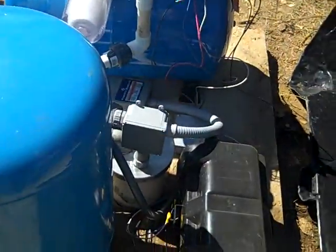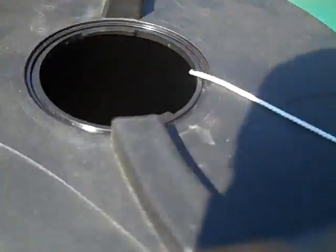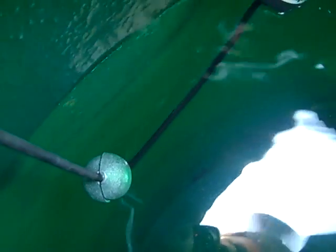Next I'll show you the tank — it's about a 1,050 to 1,100-gallon tank. Taking a peek inside — very good. We do have some plastic debris from hole saws but we're almost full. We've got a Septronics float switch in here that's just about ready to shut it off. It uses a weight to tether it down so when the water rises and the float comes up, it shuts the pump off. It's right about at that level now, just about to shut off.